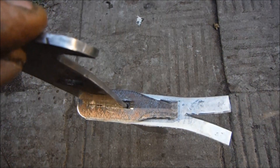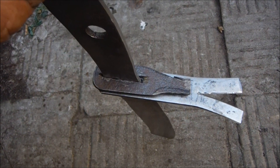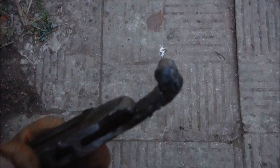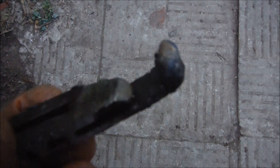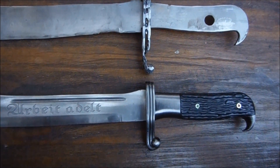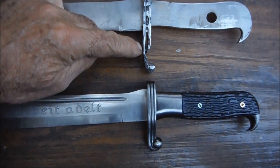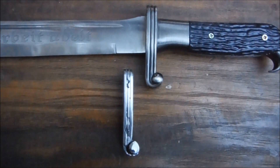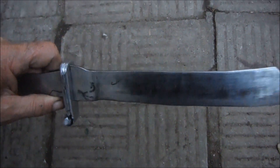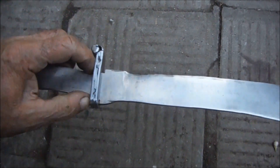Let's get the last one cut out and then I'll tack the three together with them still on the knife to keep them aligned. I've welded the smooth shank of an eight millimeter bolt to the end of our piece of steel. The next stage is to heat this up and curl it round until it's nestled in here. Making progress with the cross guard — here it is in place on the knife. It rests quite naturally up against these two shoulders.